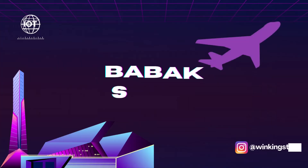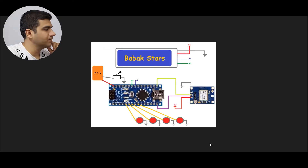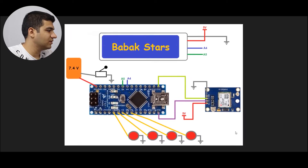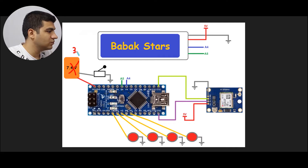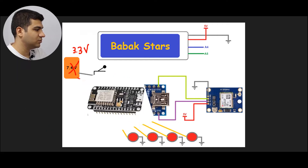This is the circuit diagram of the locator — the previous video is in the description section. I will start with the battery: I don't need two cells anymore, I only use one cell which is 3.2 volts. Because Arduino can't work with 3.2 volts, I don't need Arduino — instead I will use a NodeMCU module.